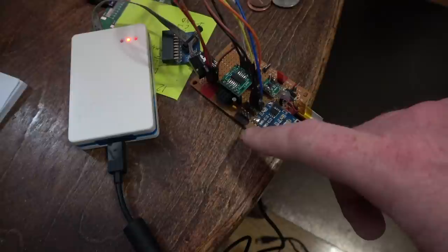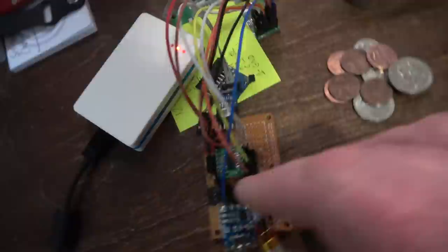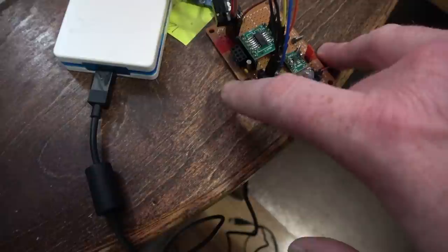This dev board has the ATTINY1614 microcontroller, which we've talked about in another video. Got my programmer here. And I've got a LiPo charging circuit and a little tiny LiPo battery. This is actually the same battery that came from that watch. So for $6, you get a battery, a screen, and a little rumble motor. So I've connected this up to the screen. I've also added a 32768 hertz crystal for a real-time timer.